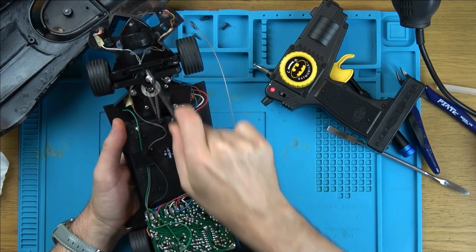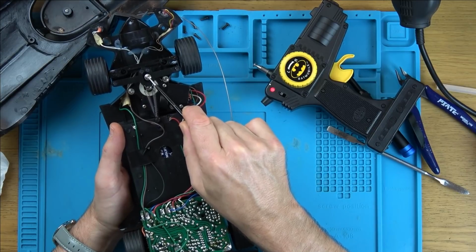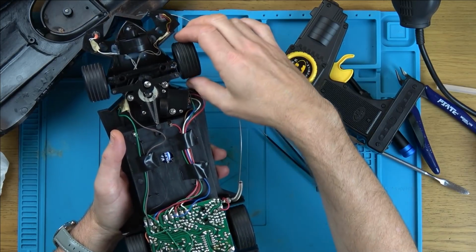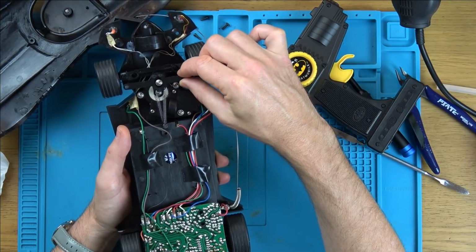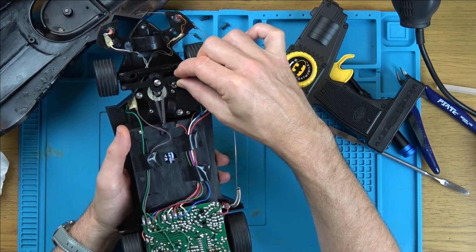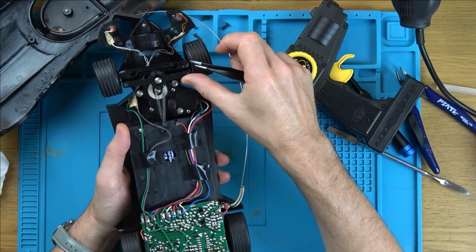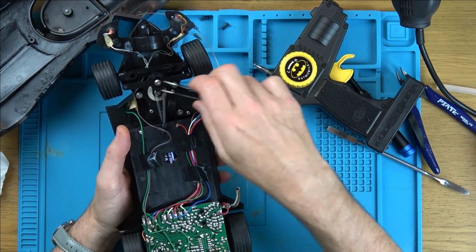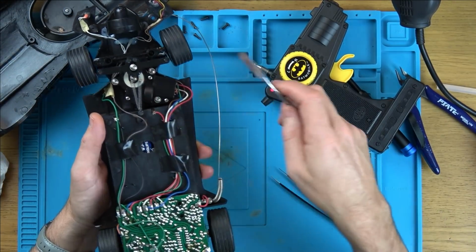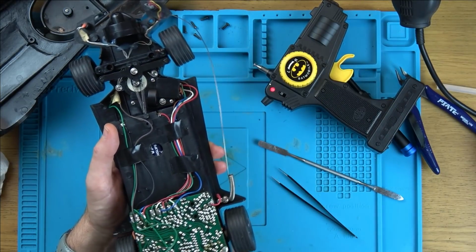But look, if you have a look, this motor is in the middle. That motor is in the middle of this. And that screw now is not in the middle of here. So I'm going to adjust the trim so that's bang in the middle. It's just that I was doing it so when it goes back, but look, we've got all that play. It's just a horrible design. We've got all that play there. Really, this whole thing should be filled up. So then there, it would be sitting like that right now. Yeah? So I bet you now, if I sit that bang in the middle there and adjust it down below, it will now go the same distance both ways.